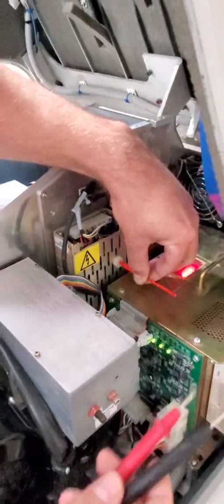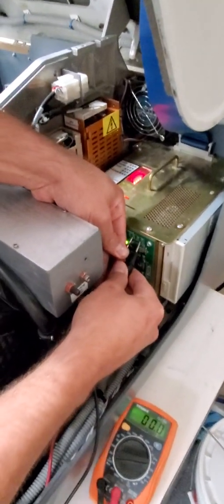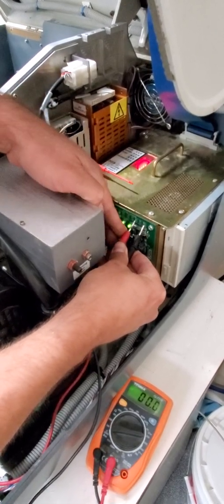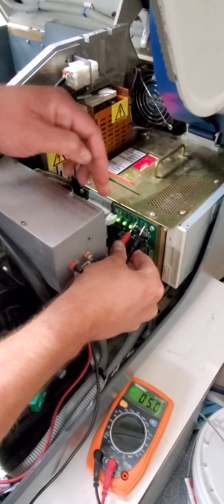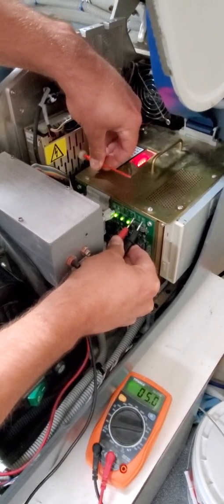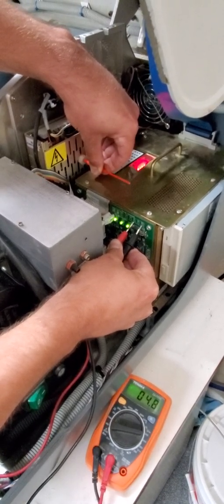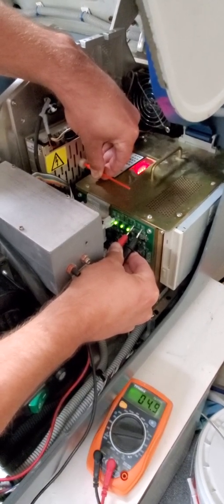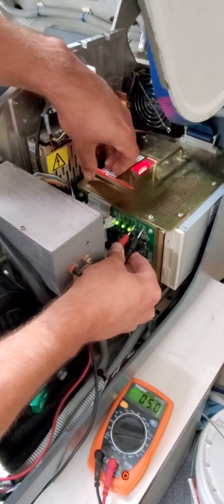What I do is hold the voltmeter on here, holding on the voltage, and once I can get it on there showing the 5 volt — it will change once I start going counterclockwise. You can see on the voltmeter it's starting to drop. And then if I go clockwise, I can bring it back up to 5. You want to get as close to 5 as possible.